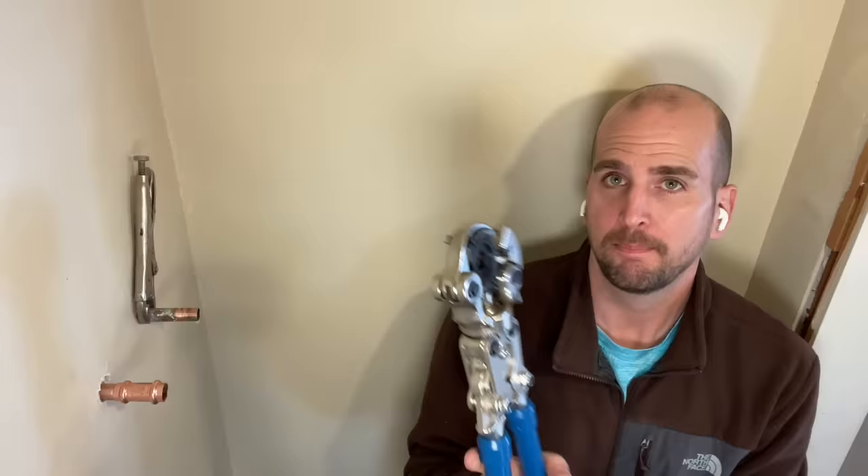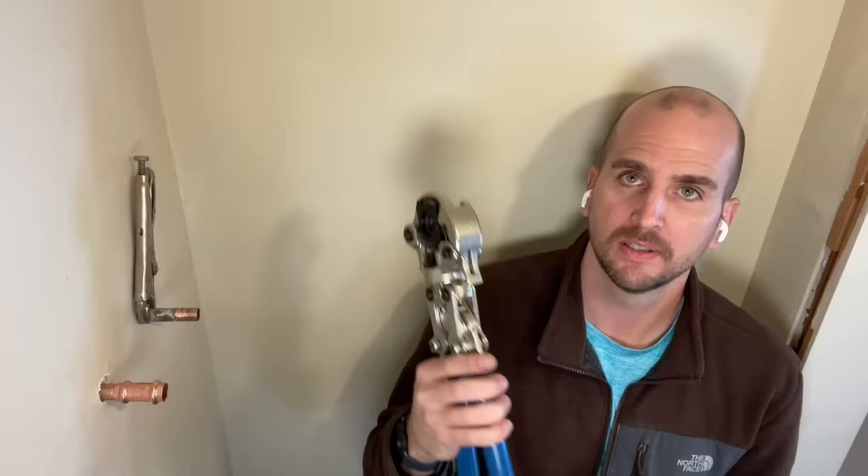For $175 — which is what I paid on Amazon, link in the description — it's a great tool to have even if you're only doing plumbing projects a couple of times a year. Why I'm testing press fittings is the speed of install. I don't have much experience sweating copper, and when I have existing copper in place and I'm just reconfiguring a little bit, it's super handy. A half-inch SharkBite T is about $10 to $11, while a Nibco press fitting T is about $3.50 — roughly one-third the price. And SharkBite fittings are bulky and just don't look as good.